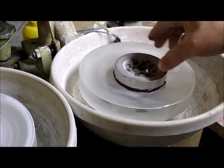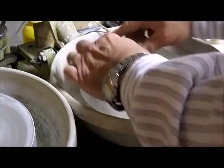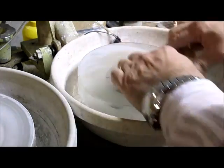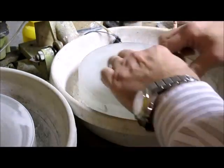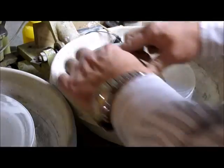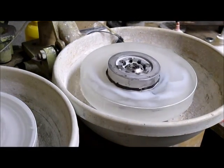For parabolizing I'm doing a combination of an oval stroke and a cross stroke with a sub-diameter tool, sort of like this, with a slow rotation on my polisher. Just an oval stroke and then across the center, all by hand.